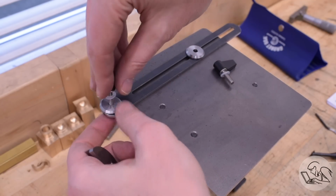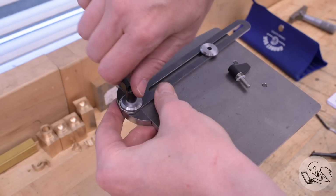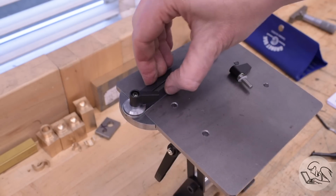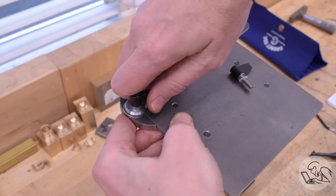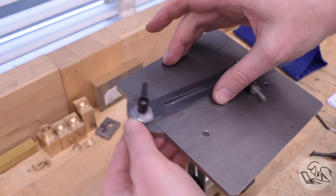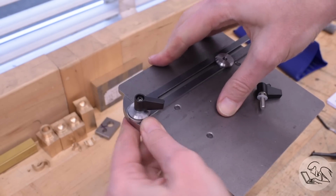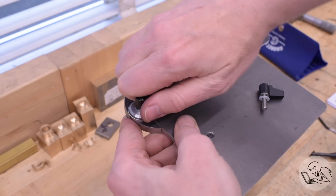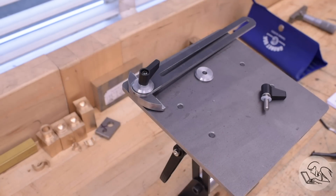That means that when I thread these pieces together, it will actually clamp the pieces together. If the top surface of that clamp was proud of the table, or even possibly even with the table, it wouldn't clamp very well, or possibly not clamp at all. But that works beautifully. One thing I've learned in this project is the secret to a really nice feeling clamping mechanism is to have just a little bit of a clamping distance, like a very small but definitely non-zero clamping distance is how you get a clamp that doesn't require a lot of motion on the clamping arm, but feels really good.